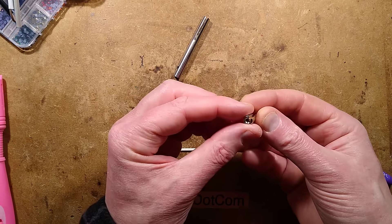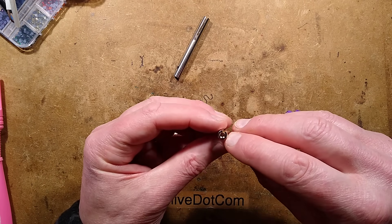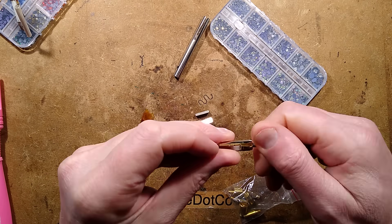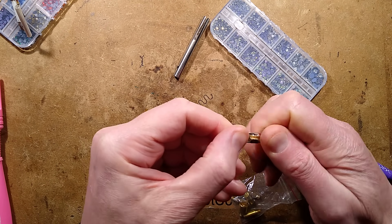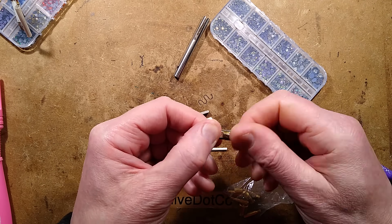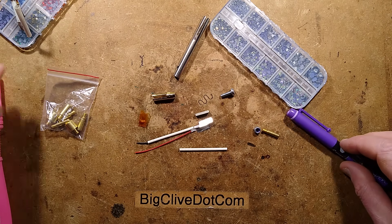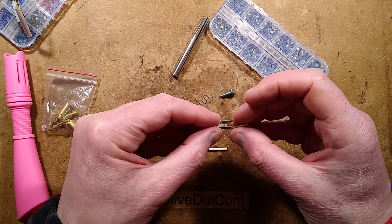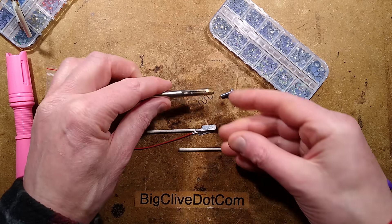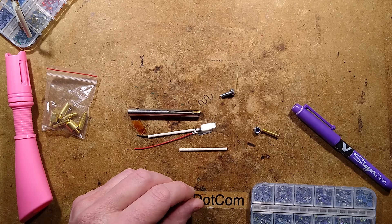An interesting little heating thing — I could see other uses for this. It gets up to about 200 degrees Celsius and it can be used for pressing things with that little — I'm guessing — M4 thread. I'll see if I've got an M4 screw to try. And the answer? Yes — M4 screws into this. You could screw it right in until it bottoms out before it reaches the point of causing carnage. So if you have M4 threaded hardware, you could put it into this for heating things. There we have it — the Diamante or Rhinestone heated insertion tool, with its little PTC thermistor with its insulated sleeving just stuffed into the end so it pinches and locks in place. Very neat and simple assembly, and a very useful little device. You can think of other uses for that sort of controlled heat source.